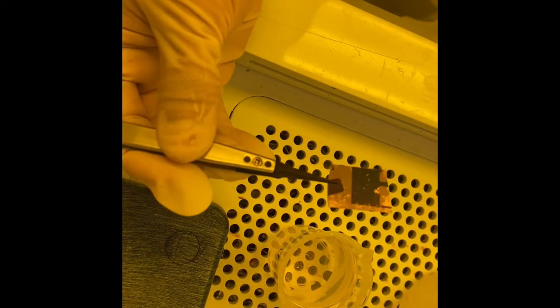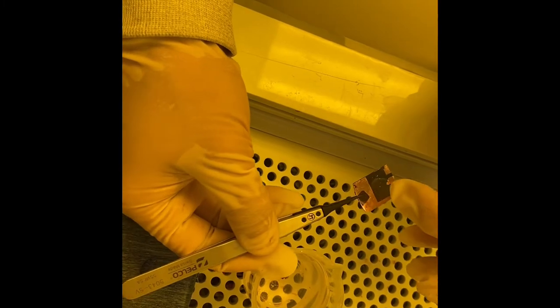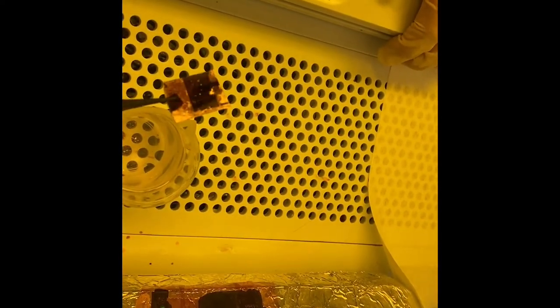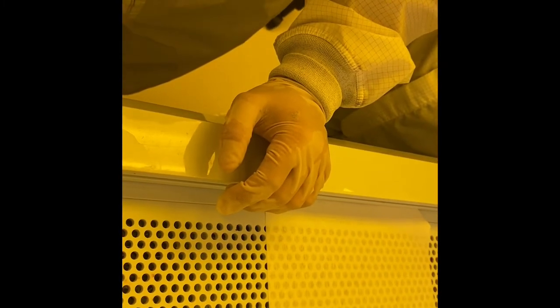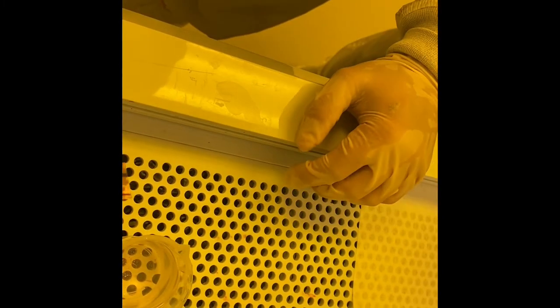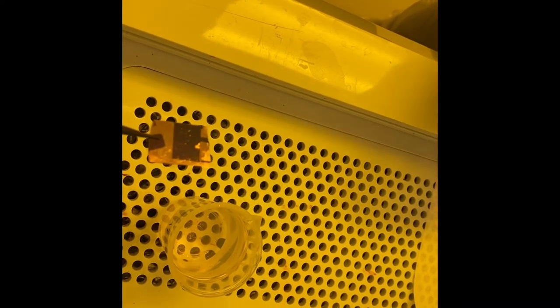We deposited copper and lifted it off. The last thing we can do now is use the profilometer and actually go over this and check the thickness of the copper. We set it for 150 nanometers, so let's go see if it actually deposited 150 nanometers or was it different. It's almost perfectly right there on the line because that was the edge of the pattern — that pattern was like a square, and all of that photoresist was gone out here.